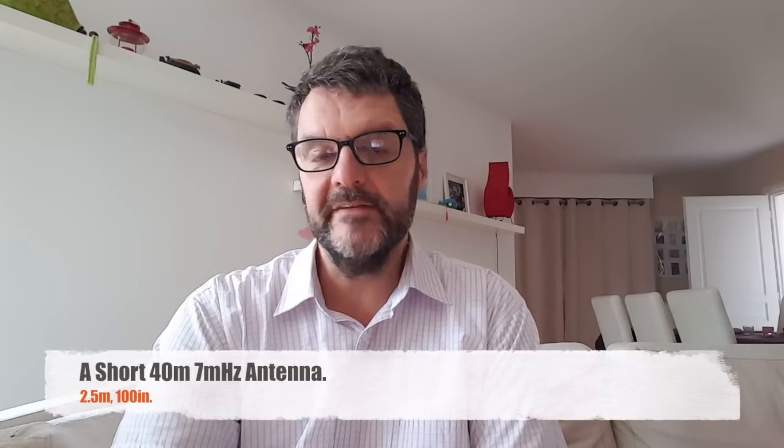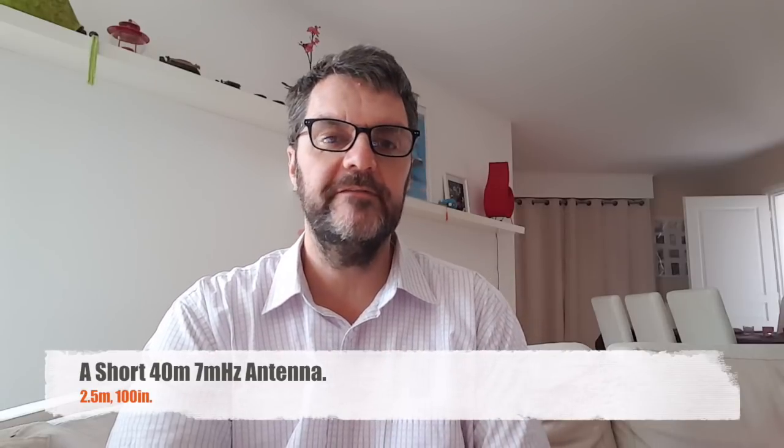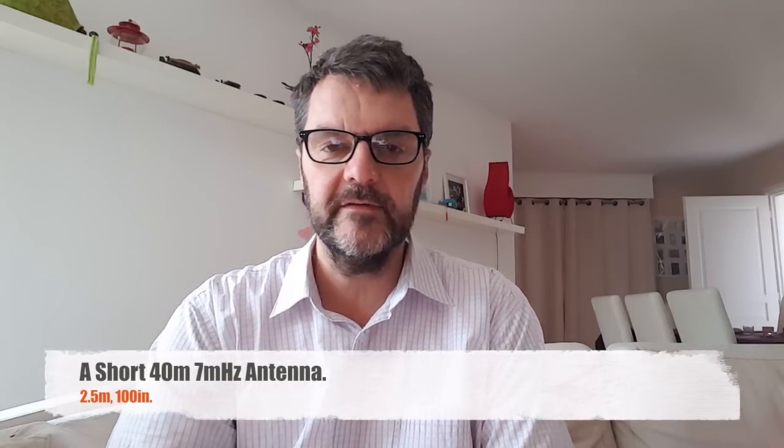You know, the single best band for prepping is probably 40 meters, 7 megahertz. But 40 meters means a 20 meter antenna, about 65, 66 feet. And that's very long, not always practical to set up. So I went looking for a shortened 40 meter antenna.